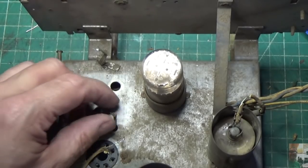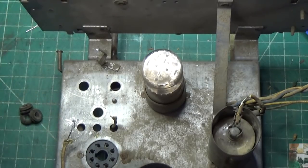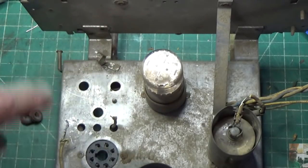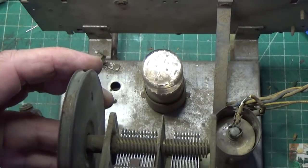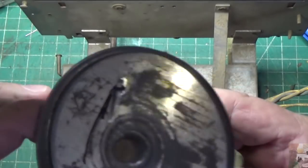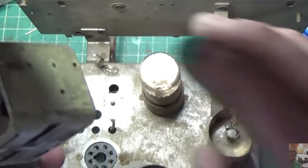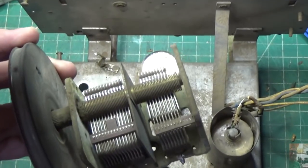Here's the wire that comes up from the bottom, here's the wire that comes up from here, and there's also a wire that goes to the top of this tube, and this is the ground strap. While we have this open we're going to clean all this out and take the tubes out and clean the top of the chassis. First order of business is to get this thing soaking — it's going to go in the ultrasonic cleaner, then in the Evaporust overnight.